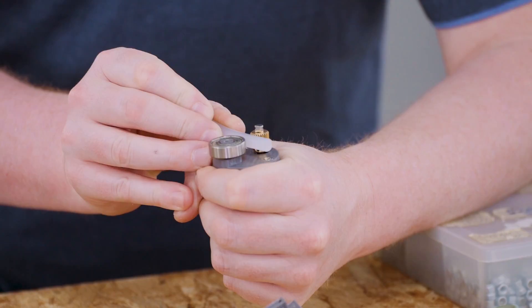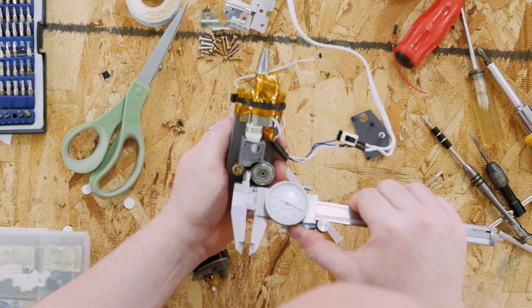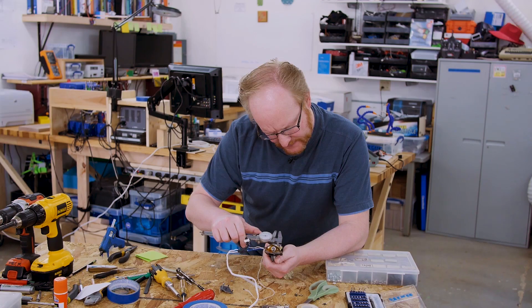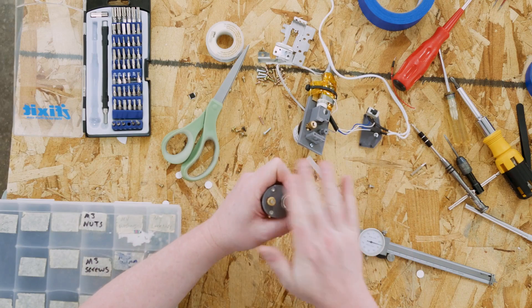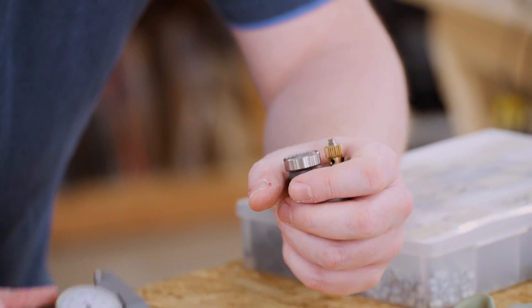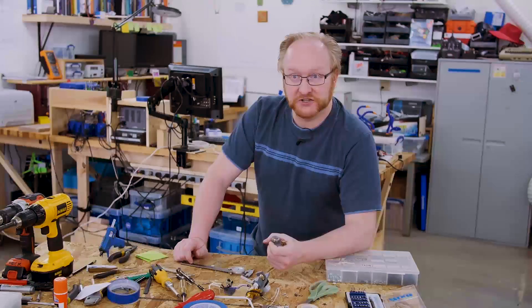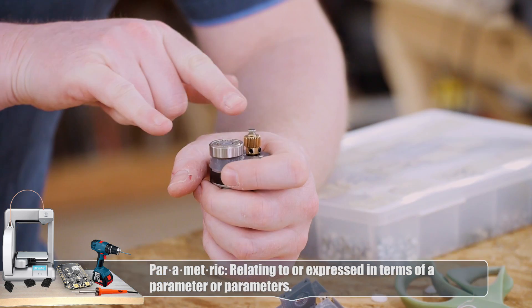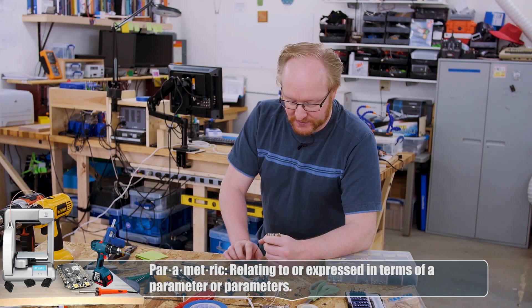Here's the latest revision - it's kind of loose. Let's measure the distance because you don't really know until you build it. This is 6.25 millimeters; this one is 6.75. So we need to make this a little closer. It's parametric, so I can just go in and change 23 millimeters shaft-to-shaft spacing to 22.5, and since this is the base it's going to move this one in a little bit. So I'm going to print another one.